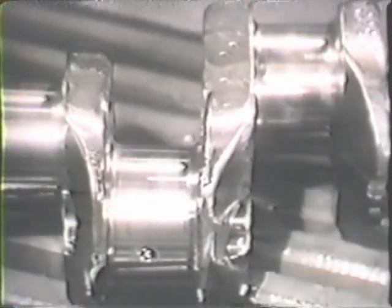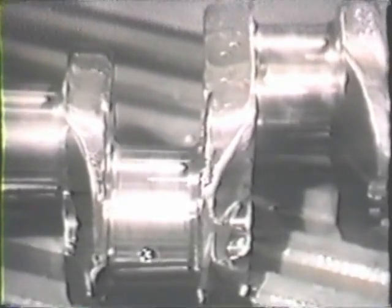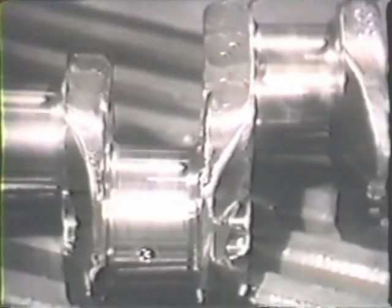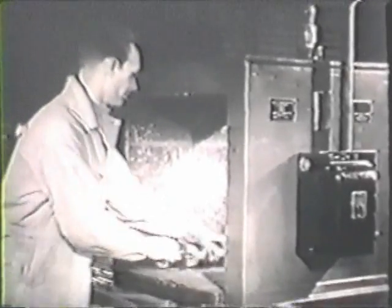This shaft is in sound shape, since there is no indication of cracks. So that you will recognize a fracture when you see it, here's a fractured shaft from another engine. Notice how the particles cling to the line of the crack and bring it into relief. A fractured shaft must be replaced. When the inspection is complete, the shaft must be demagnetized by moving it back and forth inside a coil chamber and then removing it slowly.